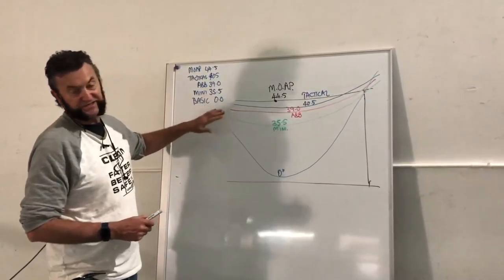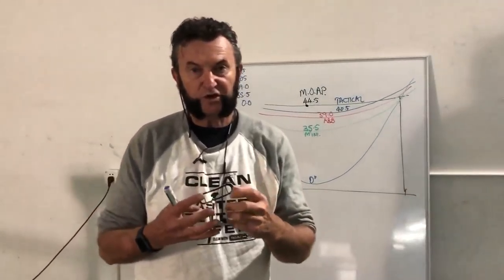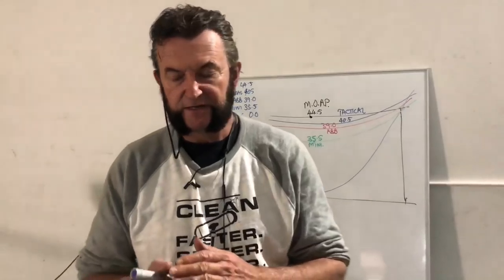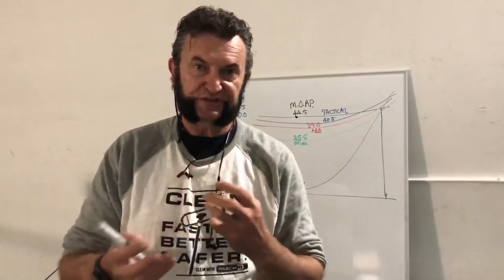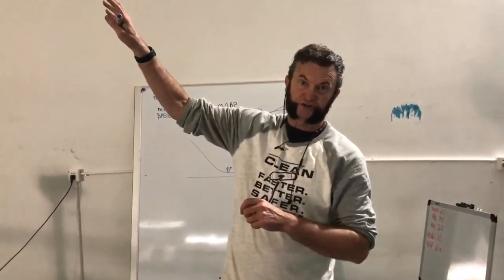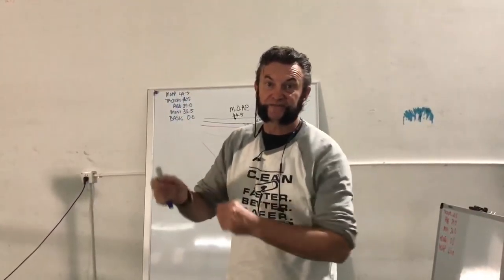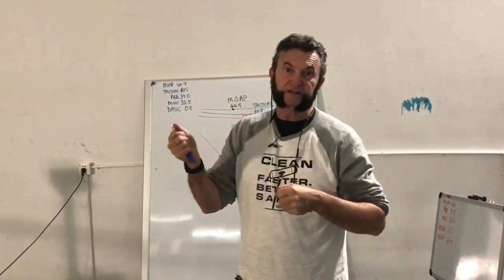Firstly, you can see the basic is a disaster, right? It's a complete disaster. What we're looking for from a water-fed pole is absolute rigidity. Now, when you're dealing with two and three stories, you're going to be using your arms, right? So you want to transfer the effort from the muscles in your arms to the brush. If you've got a pole that's flexing, then you're going to be losing your effort in flex. So what you want is a completely rigid pole.